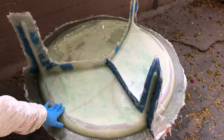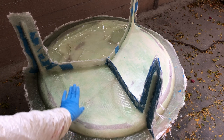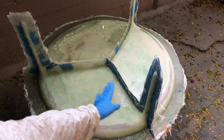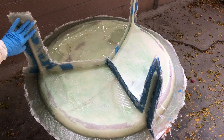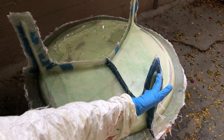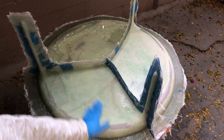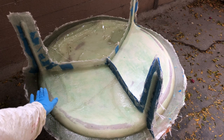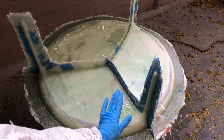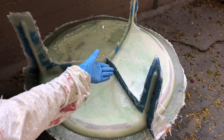This is the side I'm currently working on. After I sealed it, I did three layers of just resin, really lightly. This is the brush coat or the print coat so that I get all of the details. There's a little bit of messiness with the glass layup — that just comes from working vertically as well as it being a thicker fiberglass. But since I have those layers of plain resin underneath, it will have a really smooth detail coat. I'm going to lay the last layer of glass, then paint and wax it before doing the last side.